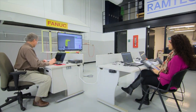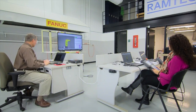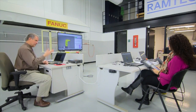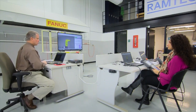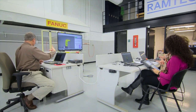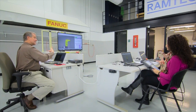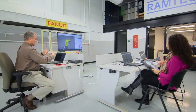Compare joint jogging against the second method on page 67: world jogging. World jogging is based on the robot's world frame. There's a center point where all of the X, Y, and Z coordinates are based, and we use what's called the right-hand rule. Your index finger points in the positive X direction, your middle finger points in the positive Y direction, and your thumb points in the positive Z direction. Each direction also has a movement in the opposite way — negative X, negative Y, negative Z.